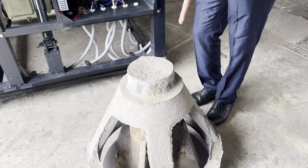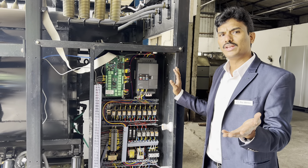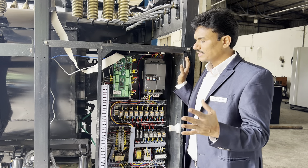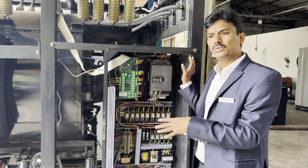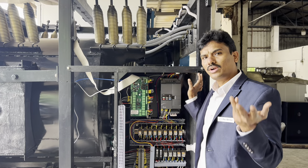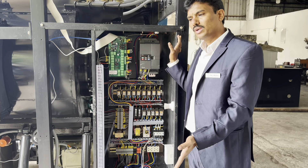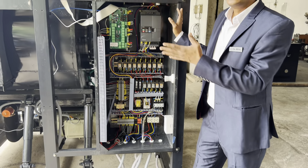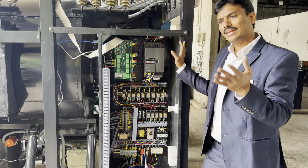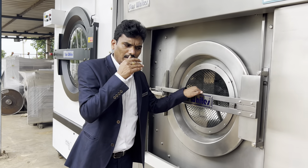Customers only see a 12 lakhs quotation versus a 10 lakhs quotation and think they are capable of comparing. But customers need to understand the design, durability, materials, motors, quality of employees, and their experience. If you put small-capacity housing and pulleys, automatically wash capacity and spin capacity will vary. The machine life will come down and shafts will break. The shaft length must match the diameter, and the housing and pulleys must match the shaft — every compromise on components compromises your laundry operation.